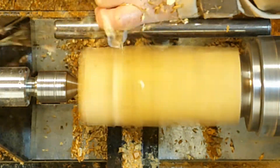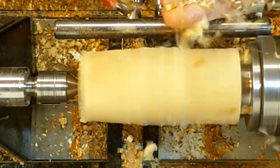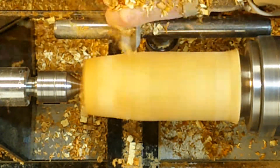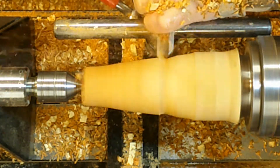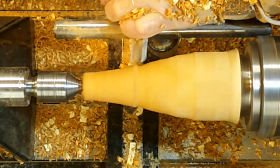So all I've got now is just a piece of yew — just a short cut of a branch I had. I've already turned a tenon on that end, put it in the lathe. I'm going to start off with the piece of yew held in the chuck, with a revolving centre on the other end. Using my roughing gouge here, just to take it all down, get all the bark and everything off, get it down to a cylindrical shape, and then just rough it away to get it down to that classical Christmas tree cone shape.